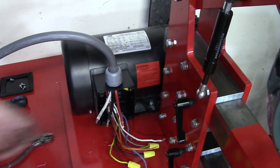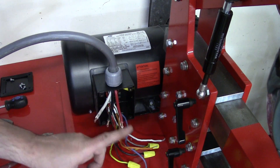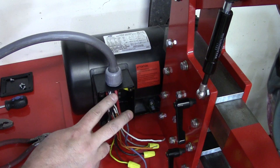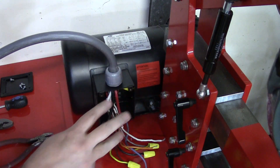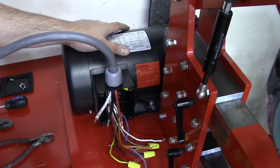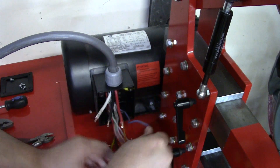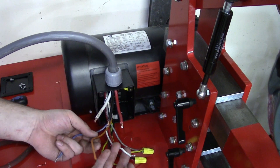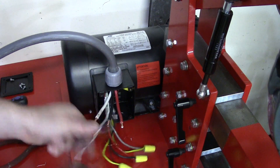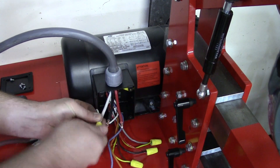Now we have our different legs. It doesn't matter which color you use as long as line one goes to U on your VFD, line two goes to V on the VFD, and line three goes to W. Some VFDs may say line one, two, three; some may say U, V, W — it varies. Looking at the nameplate, blue is line one. I have white and orange, so I'm automatically going to put white on white to make it easier to remember when connecting the other end. White is line two.